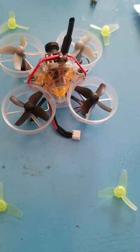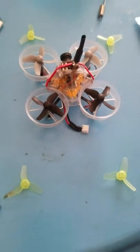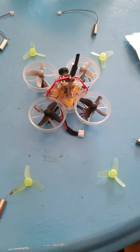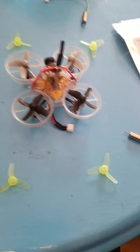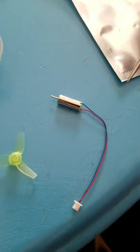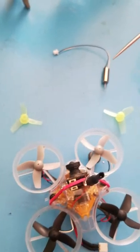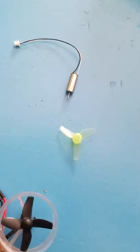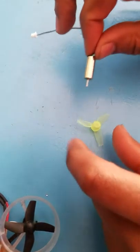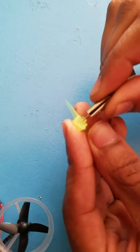Here's a B-brain Tiny Whoop that I've built, and surrounding it are all the props in the right orientation. Notice how for each motor you've got different colored wires — red and blue here, that spins clockwise, and diagonal over here, same thing. Then you've got counterclockwise over here, black and white, and diagonal down here. You're going to install the props onto the motors first.